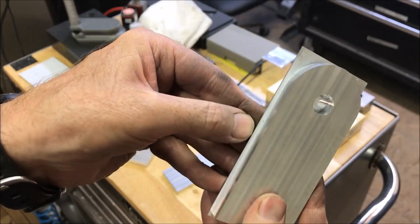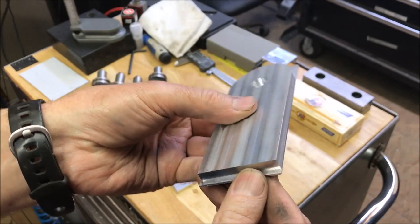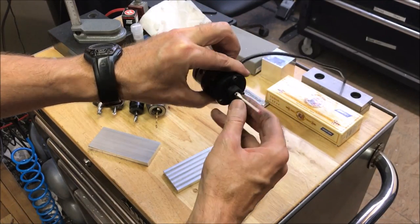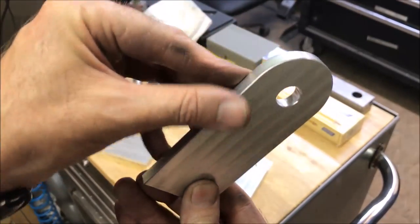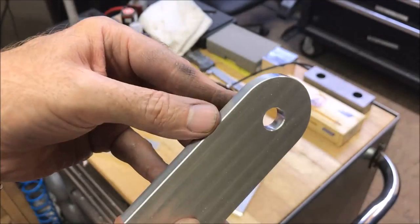This one machined more off this side and nothing off of here. And I traced that down to actually be a loose stylus, so it wasn't setting zeros in the right place. So I got that corrected. And I got pretty far on this one. Looks like the chamfers turned out pretty nice.